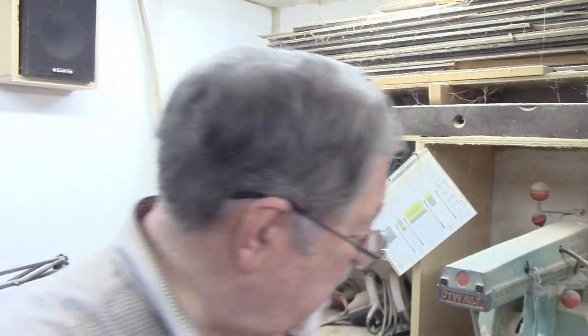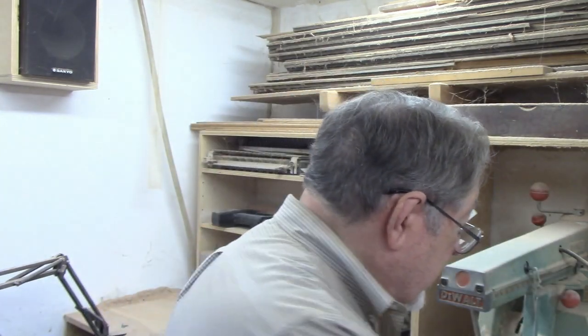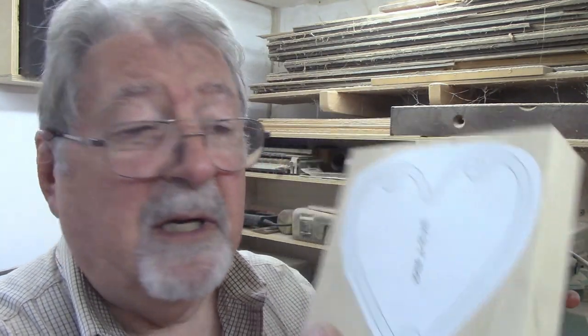Anyway, I needed some quarter inch material for the top and the bottom. I took a piece of 4/4 maple and I resawed it to 1/4 inch thick. And the butterfly I'm going to paint, so I found a scrap of poplar for that. And Steve has gone for 3/4 to 1 thick for the body.